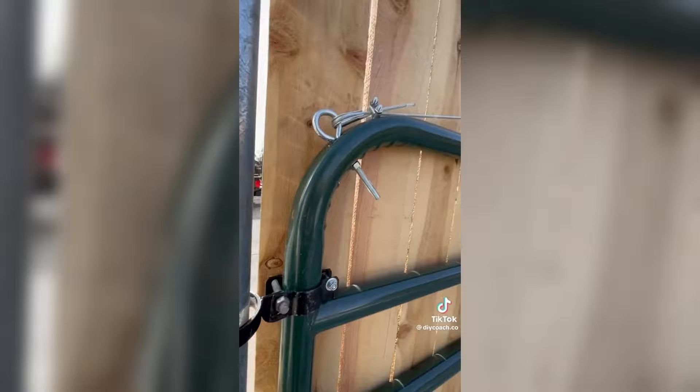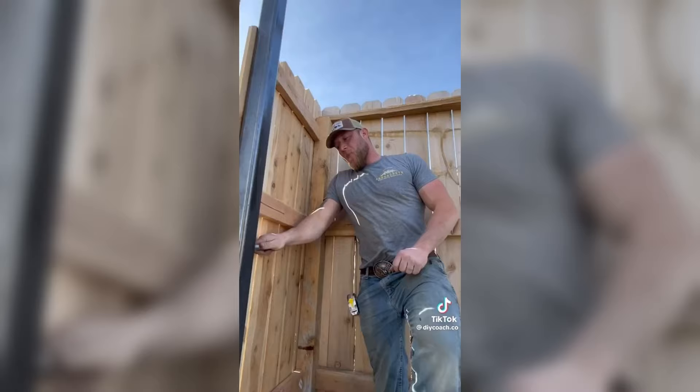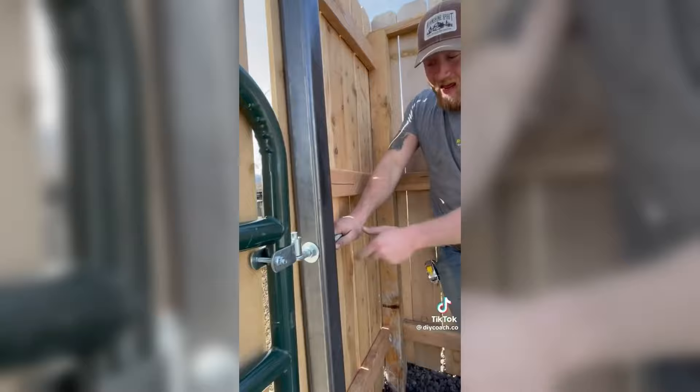The cable is to guarantee no extra sagging in the future. They drilled directly through the steel and put heavy-duty hinges on it, then put the pickets on with self-tappers into the cattle gate — and that is exactly how we do it. We use self-tapping screws to go from wood to steel. Another option is to fasten the rails with self-tappers and then nail your pickets to the wood rail, just like you normally would, so you don't have to use self-tappers on every single picket.